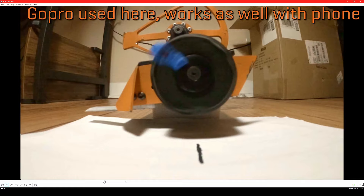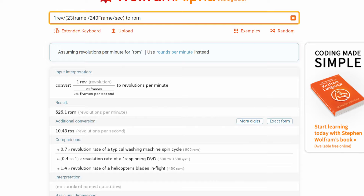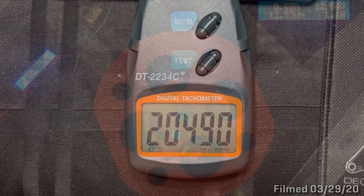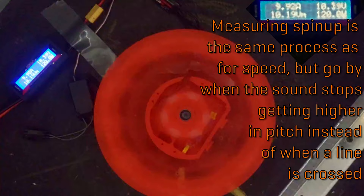Anything that spins slower than 240 times per second — which is 14,400 RPM — you can pretty easily determine the rotation speed of using a smartphone camera at 240 fps. If you place a marker on a robot's wheel, you should be able to count how many revolutions it completes in how many frames, and use a little math to determine rotations per second and then RPM. Any bot with wheels going over 5,000 RPM is pretty nuts, so this probably works amazingly well for drivetrain speeds. However, with weapon speeds — particularly at the insect scale with speeds over 14,000 RPM — this becomes harder. You can, however, buy a $15 laser tachometer, which will easily read up to 99,000 RPM. This isn't very safe to use on a spinning metal weapon, but it will let you verify your motor's real-world KV, or you could use a plastic printed mock weapon and measure that. The top speed of the weapon is going to be limited by air resistance more than the weapon's inertia, so this should be reasonably accurate.